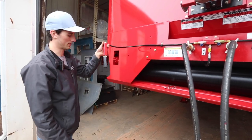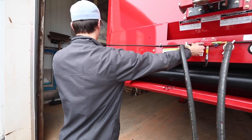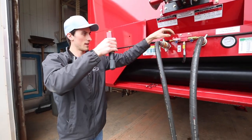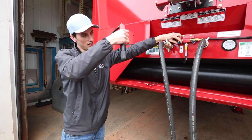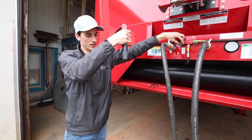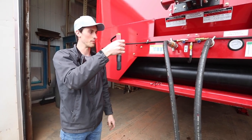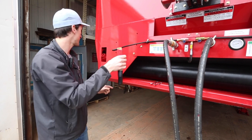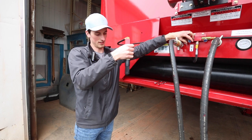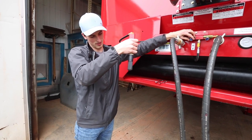At this point it's in your hand. Now that you can watch it, you can control the flow of oil. Turn this counter-clockwise to turn up the flow. You want to adjust it slowly until you see oil coming off — basically you want it to be a drip but not a stream. The best way it was described to me is you want it dripping on every roller as the chain goes by. So turn this up slowly until we get oil.